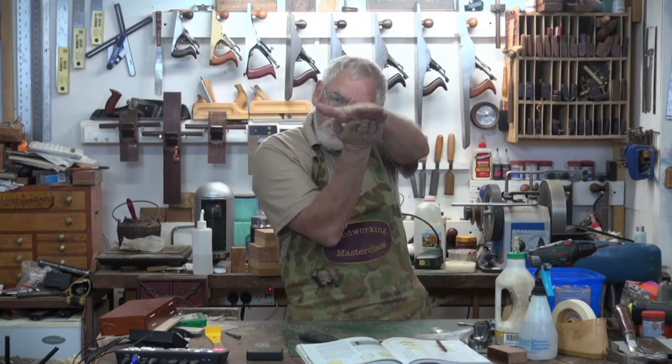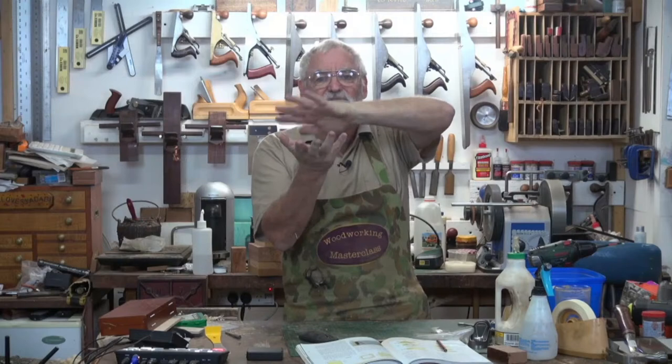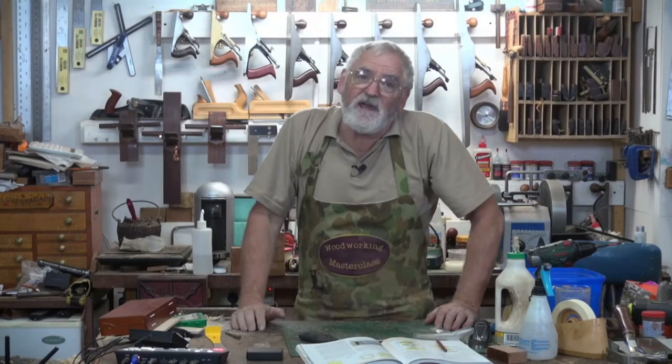Does the edge of plywood sand much different from regular wood? Yes, it does. The reason being, when plywood's made, it's at 90 degrees, so you've got one sheet of veneer going that way, and then one sheet going that way, and then the top sheet. And if you look at plywood, it's always uneven numbers. It's either 3-ply, 7-ply, 9-ply, 11-ply, because the two matching outside pieces have to be the same orientation. So it does sand a bit differently. It definitely planes differently, because while you're planing, you're planing long grain and short grain at the same time. That's another reason you've got to have really, really sharp tools, especially with plywood. And it will blunten your tools quicker because of the glue that they use. A lot of the time it's a resorcinol formaldehyde-based glue, which is very, very tough on blades. So I hope that one helps you.